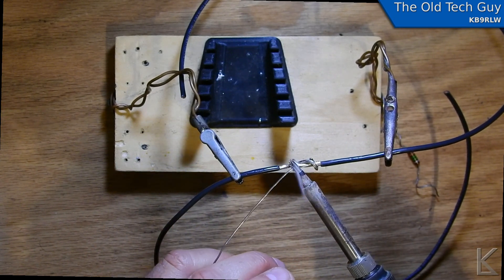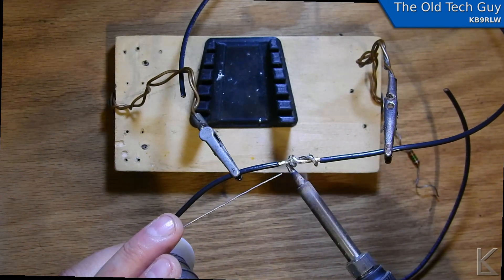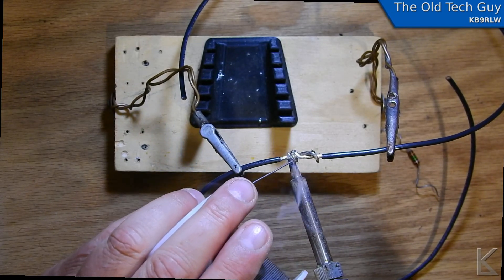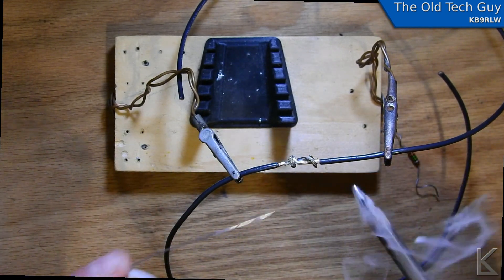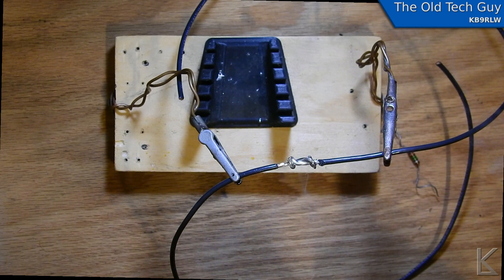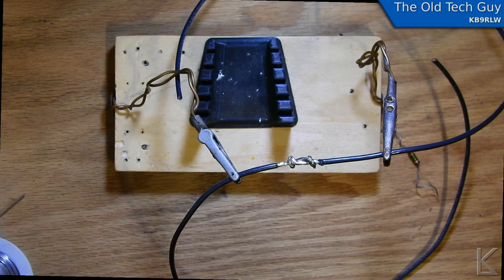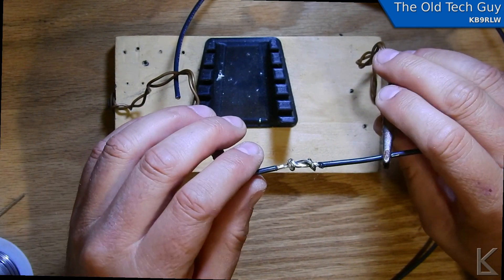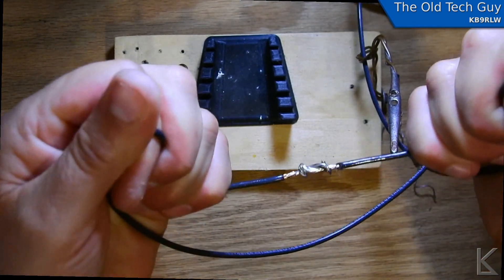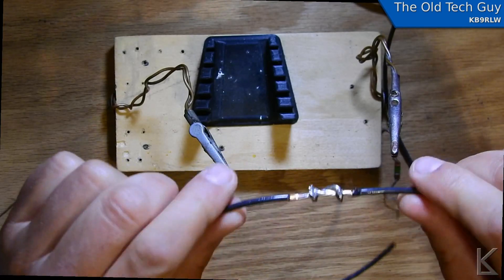Use the traditional iron this time since I'm inside. How much solder you use is up to you — you could put a bunch of solder here so you really fill it in. One ham up in Fort Wayne was telling me he doesn't like to do this because of the RF skin effect — that RF flows on the skin of the wire and the solder is going to oxidize and create resistance at that point. Well, that antenna that I had up with this splice — I actually had two sets of these splices in it — it was up for six years and the characteristics of the antenna never changed. And that is plenty strong; I can put all the tension I want on that and it's not going to come loose.